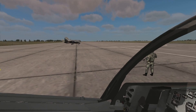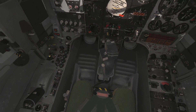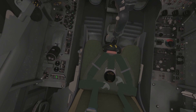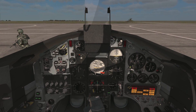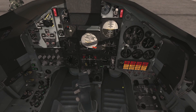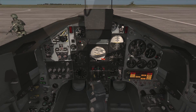With it being a training aircraft, it is pretty simple. For starters, let's turn on ignition. Turn on batteries 1 and 2. At this stage, our lights come on. Let's cancel our attention getters, and run the caution and warning panel through a test to make sure the bulbs are all okay. They are — we cancel that again.